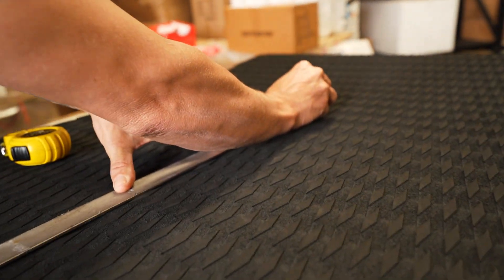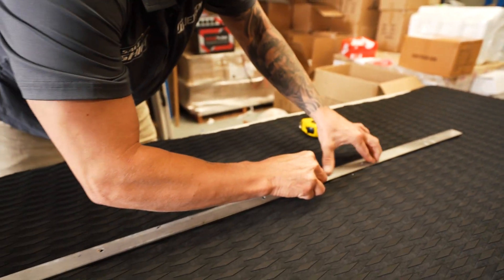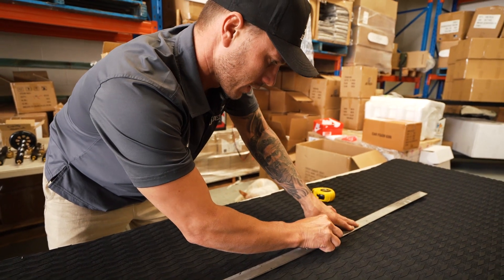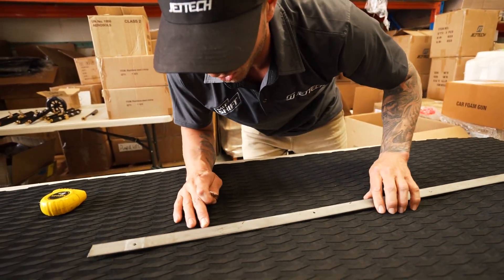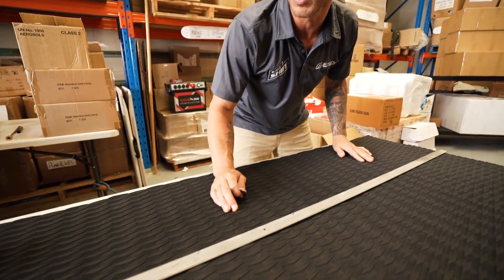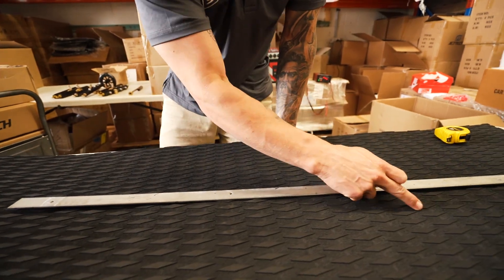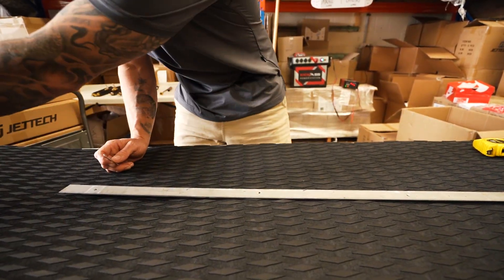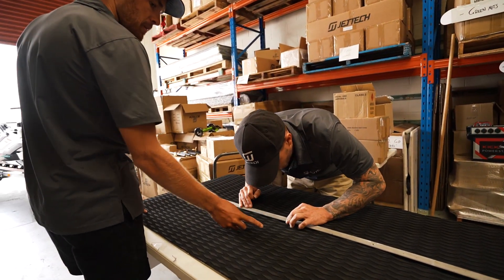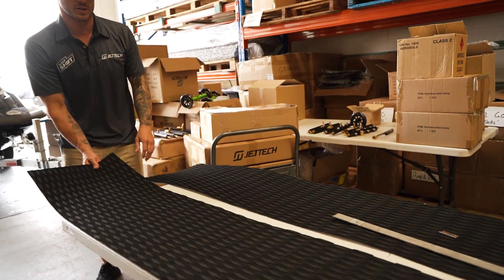Get yourself a work table — I like to use plastic trestle tables. Cut nice and straight, going directly down. You don't want to be cutting at an angle because you'll see the angle in the turf cut. Always take your time — that's why I say it's not a five-minute job. You're better off cutting directly because if you're five mil out, it won't be a straight line. There you go — two halves. Another thing to note: the type of turf we use has angled grooves with a diamond cut.